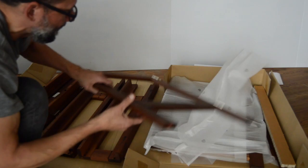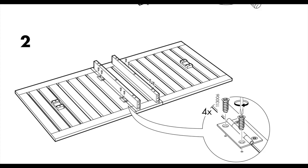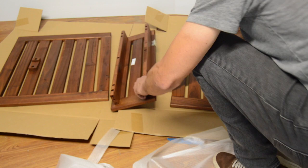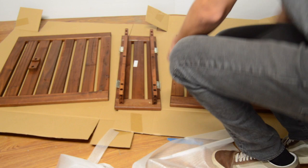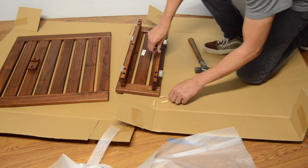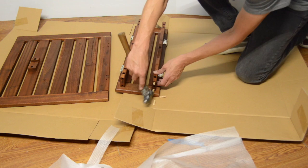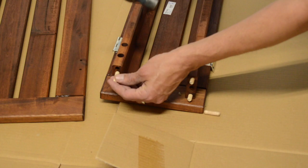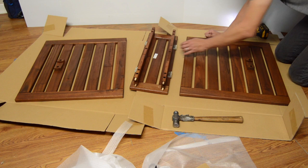What I like to do is basically open and unwrap everything and just lay it all out where you can get a good visual on everything. The first step, we're going to be pressing eight of these dowel pins into the center section and then bolting the two folding tabletop ends together. The two end pieces are identical and the center piece — it doesn't matter which way you have it. Just line the hinges up with those little holes. We're going to put two on each end of each of those upright boards there — in the highest and the lowest hole. Some of them go in pretty easy and some you kind of have to tap them in.